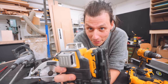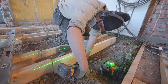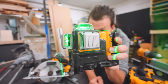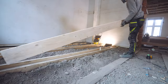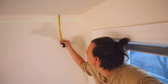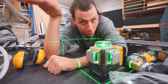The first tool I found incredibly useful during these renovations is a cross-line laser. I bought this tool specifically for the renovations really early on and I've used it so many times for so many different things. What it actually does is project up to three lines all the way across the room, and all the lines self-level and are 90 degrees to each other. We used it right at the beginning when leveling off the new floor, and the same thing for the ceiling - just raising boards up to the laser lines and screwing them in.